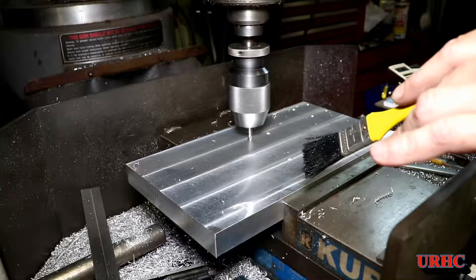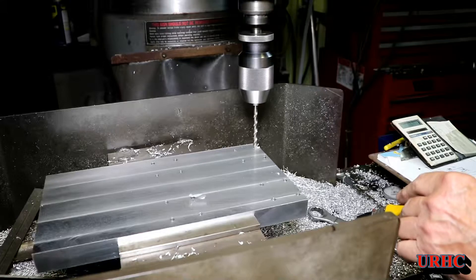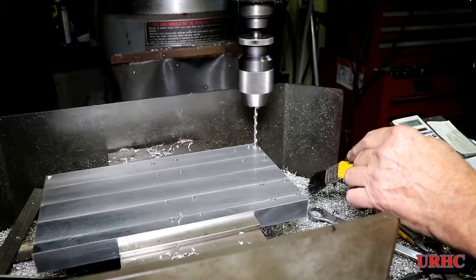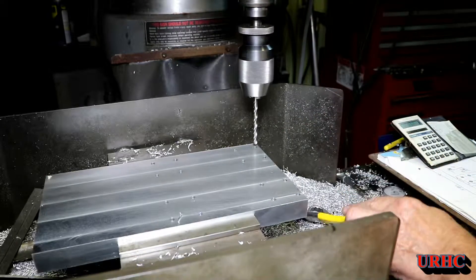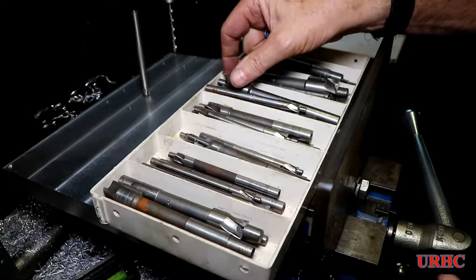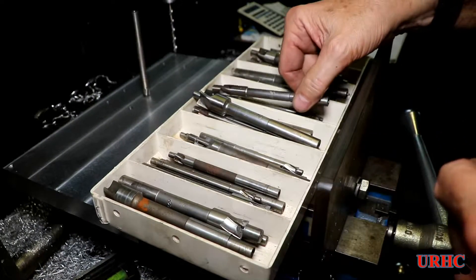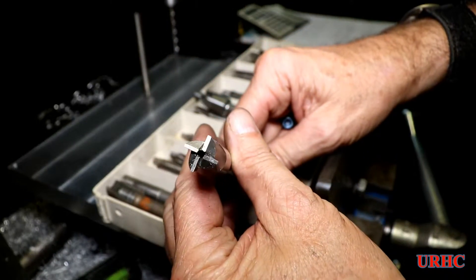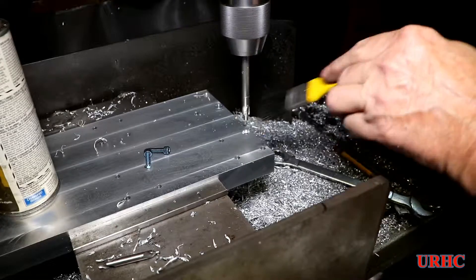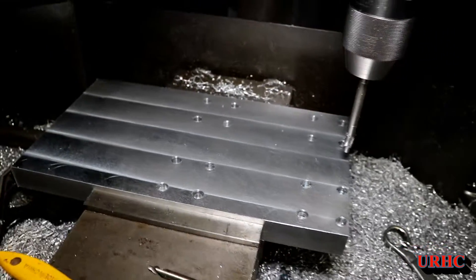It's just a matter of starting with the center drill to locate the holes in the right spot, then going back with the drill bit. I'm just going to show a couple of parts being started - I won't go through all the machining because I probably have a hundred hours in the parts made so far. One of the good things about buying an old milling machine is you get a lot of tooling with it, like these counterbore bits. Finding a machine with cutters and tooling included really saves you money. I used those counterbore bits for the slide mounting holes - set the depth stop and it only takes a second.